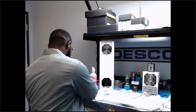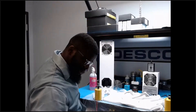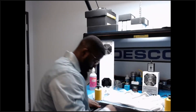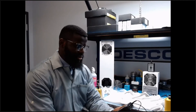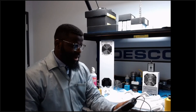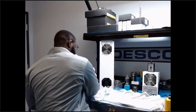The smock is spread out on the insulated surface and two five-pound weights are placed on it. The surface resistance meter's black cord connects to one weight and the red cord to the other. After turning it on and conducting the sleeve-to-sleeve test, the resistance reading is 1.82×10⁶ ohms — well within spec.